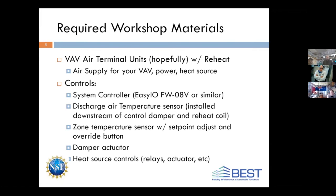You'll need a zone temperature sensor, preferably with a set point adjust and push button or unoccupied override. You'll also need some sort of damper actuator appropriate to your system and heat source controls. If you're running electric reheats, that's probably going to be relays. If you're running a hot water valve, it's probably going to be an actuator. If you've got a variable electrical system, it may be an SCR type control where you'll send a 0 to 5 volt or 0 to 10 volt control signal.